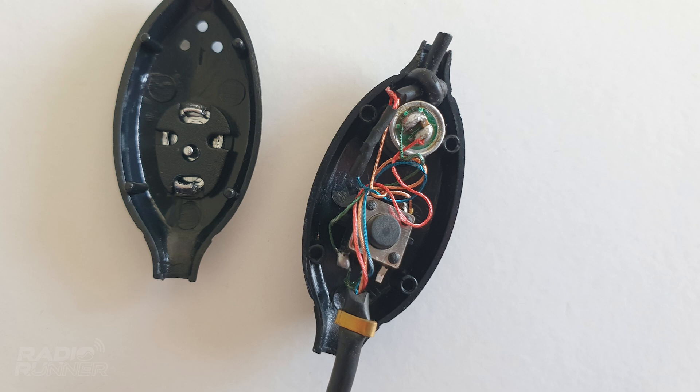If you can identify one, you know what the other is too. The mic is the green circle up top. It has two wires coming out — one is positive, and the other is ground. That red wire is my positive wire — that's the only one we care about. You can tell because the other wire is connected to the PTT; it's the ground wire. My positive PTT wire is the one coming out of the bottom left of the switch. There are only two wires in your mic and two wires in your switch, and you know one is ground. In this case, the mic and PTT are connected via the ground wire, so you can easily see which one that is. A multimeter is super handy here to check for continuity — it will beep at you if you've made an electrical connection, and you can use that to confirm that the wire at the top in the clamshell is actually the same wire you're playing with at the plug end.